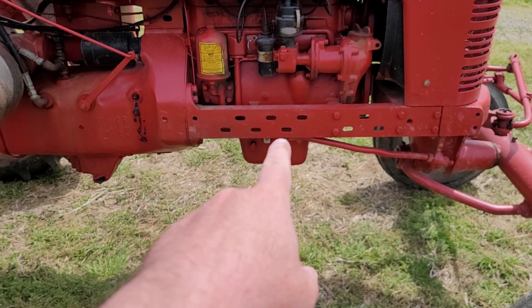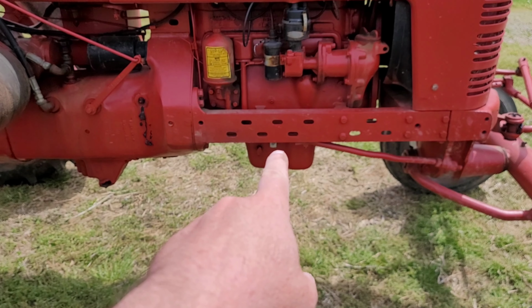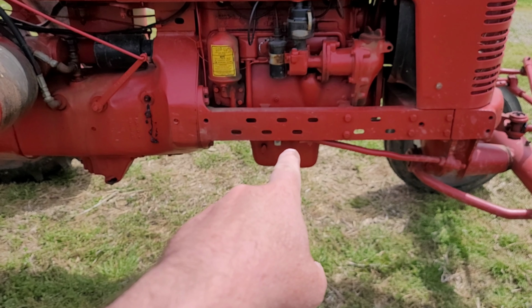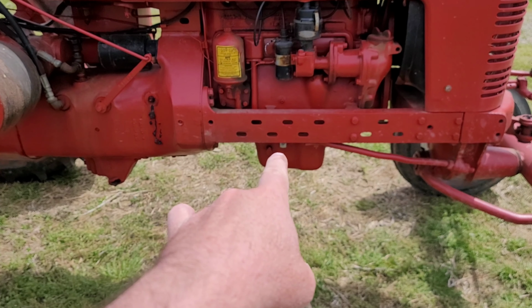The one thing I will tell you, obviously I put the dipstick in, but if you have the double petcock, if you pull the top one and nothing's coming out, you pull the bottom one, I always used to just go by the standard. If it's coming out the bottom one and not the top, figure about 1 quart low. I've learned that dipstick over the time I've had it in there, and I can tell you right now, we're not quite 1 quart low, maybe 1/2 to 3/4.